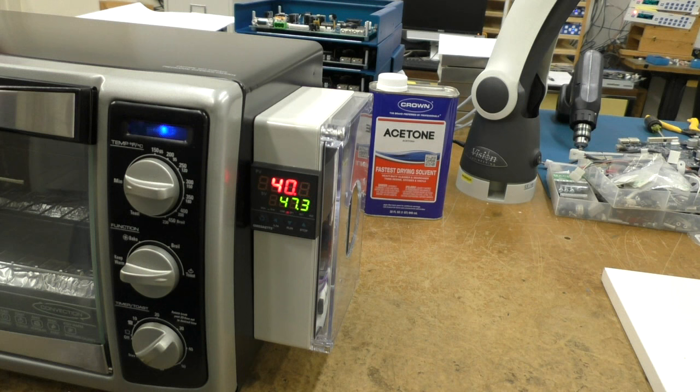See, right now it starts cycling because it says, oh, well, if I keep the heater on, it's going to overshoot and it'll get too hot in there too soon. So now the heater's not even on and the temperature is just coasting. And see, it's approaching and following it fairly closely now. The temperature's still coasting, but the coasting's going to slow down and it will realize that. And see, it overshot a little bit, but that's fine. It's only two or three degrees, so I really don't care too much.